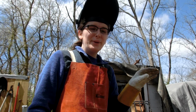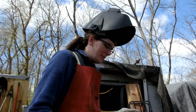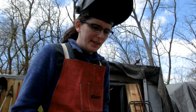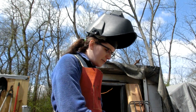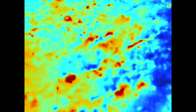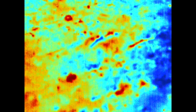That was pretty cool. I was actually melting that piece of brick that I was pointing it at. Anyway, about this camera, it seems that it did slightly kill a few pixels, although it only made them out of color. So whenever I move it around, that pixel is kind of dead. The people at OpGal also said that if you let it sit for a while, it might go away as the temperature equalizes.